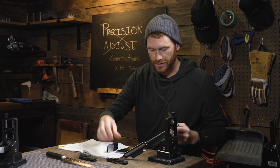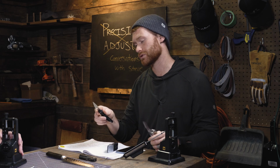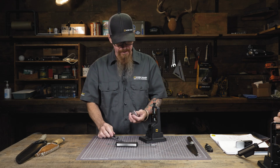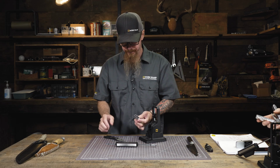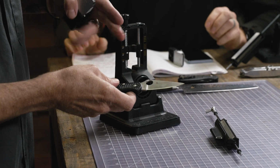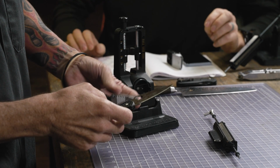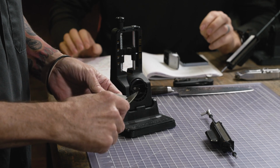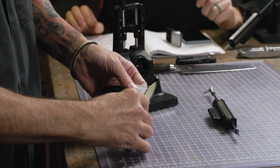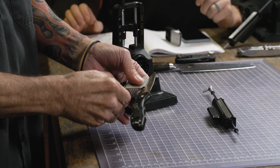Yeah, let's show it here. Someone asked if it clamped to a Spyderco or a leaf-shaped blade, and I just wanted to see how you would do that. Yeah, it's basically, we're going to clamp this the exact same way we do any other knife. We're going to center the clamp on the blade. The challenge is that the top of the knife here slopes down so fast. In order to keep your cutting edge parallel, can we still get a good purchase on it? So if we center that on the clamp, get the cutting edge straight, just pinch that there.